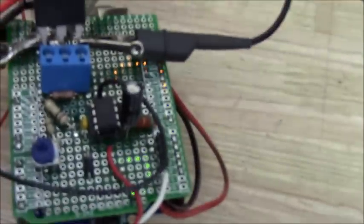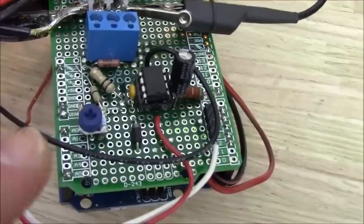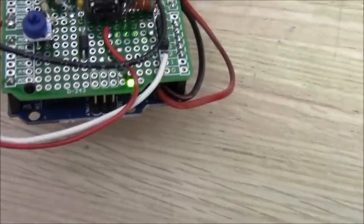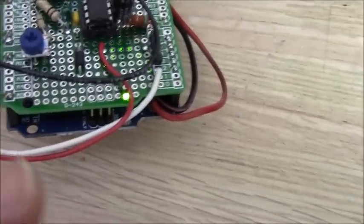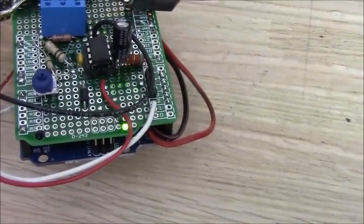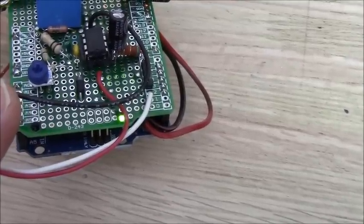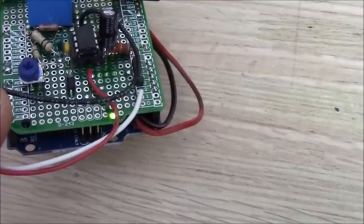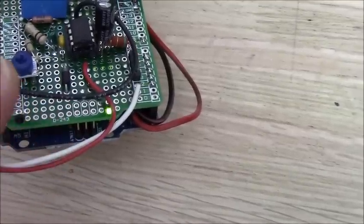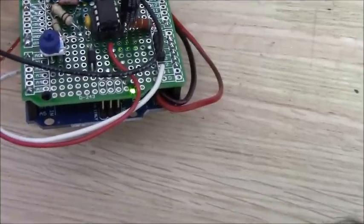So let's look at this. Here I've just added this so I could replace the MOSFETs without having to solder them. This is the potentiometer that I was talking about, and I have it turned down probably halfway. In the Arduino code, we program it to have a certain on-time max. Right now it's really too high for this particular setup, because as you saw, if I go any higher than this, it starts to bog down the motor and the charging rate isn't as good.